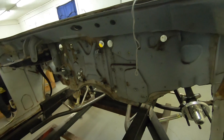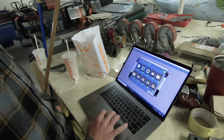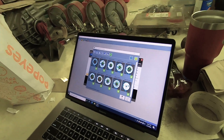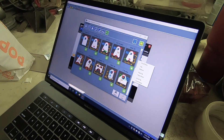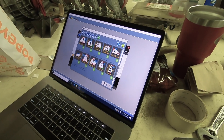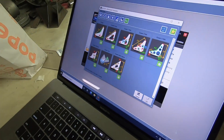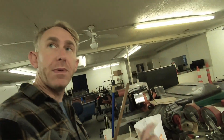It'll be like the central point. We can make end caps for the cage, we can do landing pads, we could do beadlock rings if you decided to off-road it — suspension tabs — those will come in handy. All completely customizable. And then we just find a local laser or plasma shop and have them cut mounts for things, gussets, saddle gussets — like tacos. We can have those made, pre-cut out of flat steel and then bent into place.